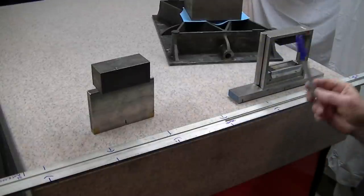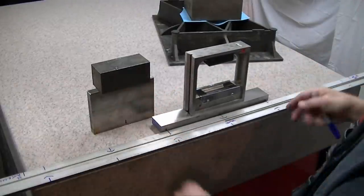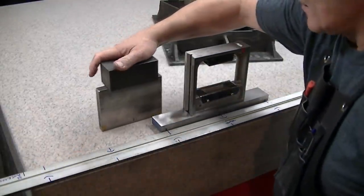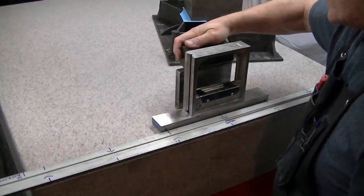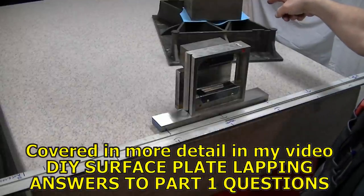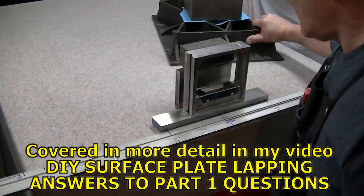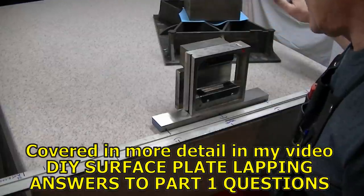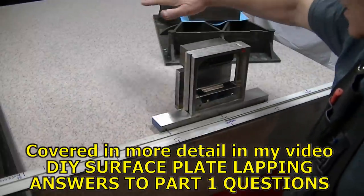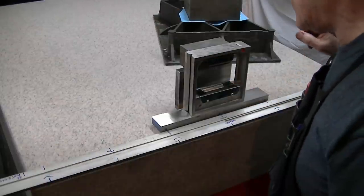So first, I put this centered, because on this one there are only going to be three places here, and then the foot location here and here. This is my counterbalance we discussed before to offset the influence of the plate. And the lap is still sitting on there because I'm using the lap to tweak my position. And right now, the lap is just about in the right spot. So simply by moving the lap weight back and forth laterally to change the weighting of the plate, I can tweak my reading so I get my bubble perfectly centered.